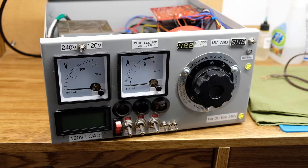Hi there. I wanted to go over today one of the instruments I built, which is not really an instrument but what we call an isolated power supply. This is useful in any lab for testing unknown equipment, or in some cases you want to power up something gradually from zero to 120 volts, or in my case also zero to 240 volts for 240-volt equipment. I've seen many hobbyists build such things and this one is something I built out of necessity.